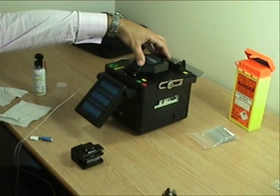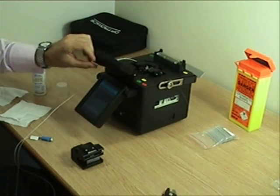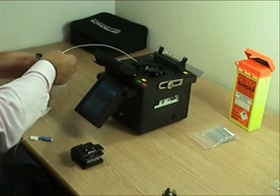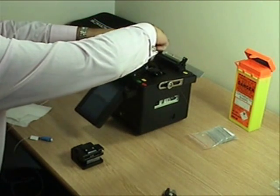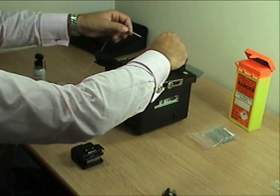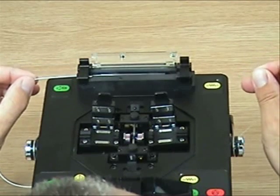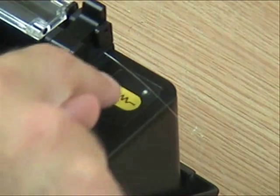Lift the windshield and a tension test will be carried out to check the strength of the splice. Open the heat oven and move the splice protector close to the clamps. Lift the fiber clamps and carefully remove the fiber. Place the splice protector so the exposed area of fiber is in the middle, place in the oven, closing the lid last which applies tension to the fiber.